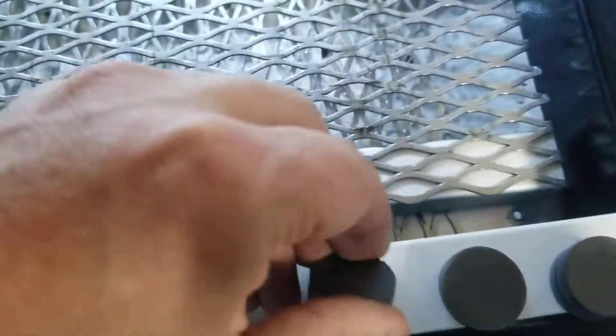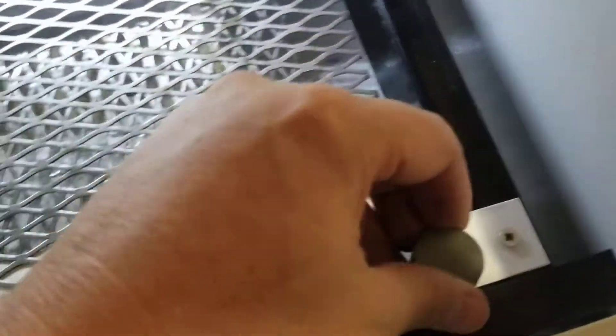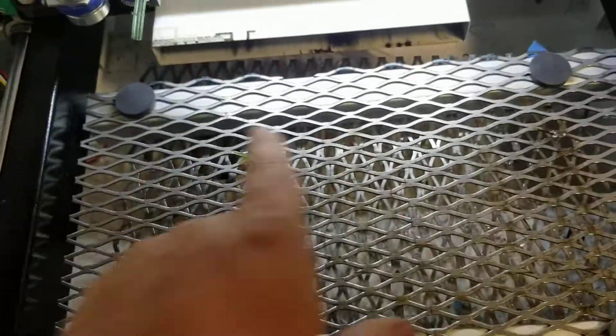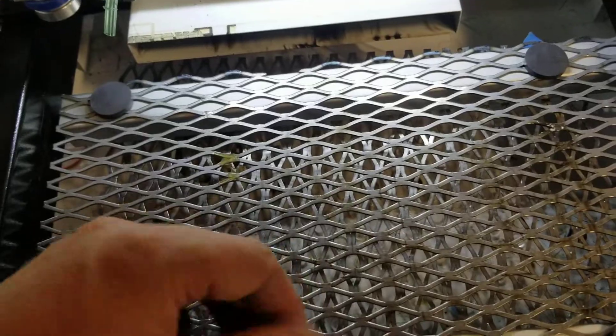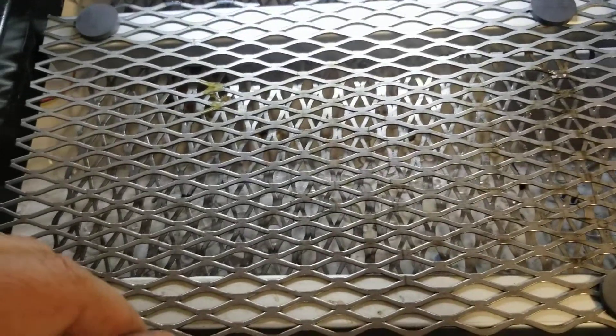You'll notice I have some magnets here. These magnets help me put down a piece of paper on here, then I can drop the magnets on to secure it — I don't have to worry about using painter's tape anymore. I can drop them over the piece of paper in all four corners, cut my first sample panel out, make sure everything looks good before I put the acrylic down. Once the acrylic is down, I can also use these magnets to hold it in place during cutting.